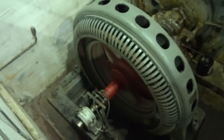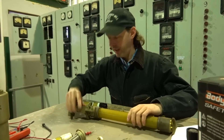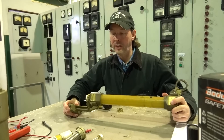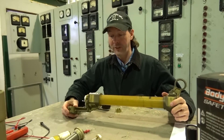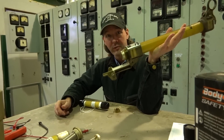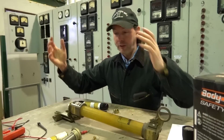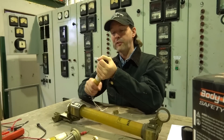This is so cool — I'm actually turning off a power plant. So I am out here today at a big power plant because they blew a fuse, and this fuse is not the kind of thing you want to go messing around with. This is a 14,400 volt fuse rated for 200 amps, so that's a lot of watts. Those of you who followed the Captain's Blog and the High Voltage Lab videos will remember a couple of these that I actually have in the High Voltage Lab, and they're off in a storage unit now, which would have been really handy, but they had to go special order a refill for this.